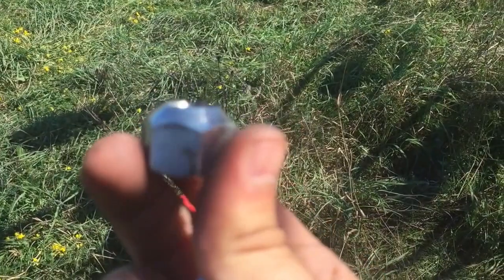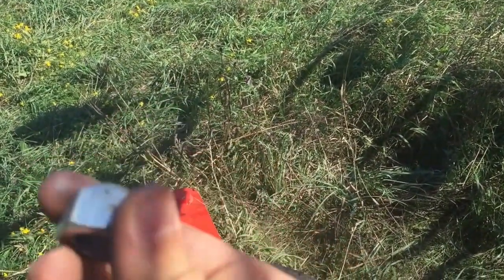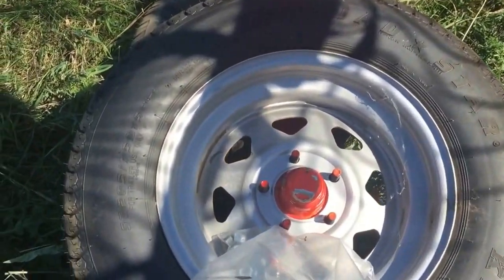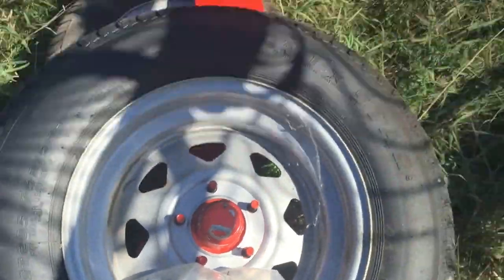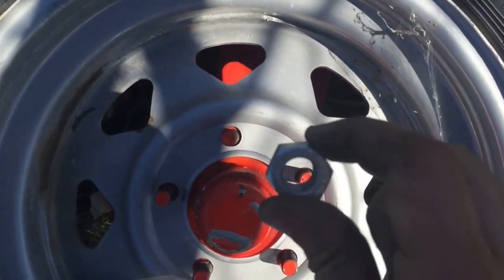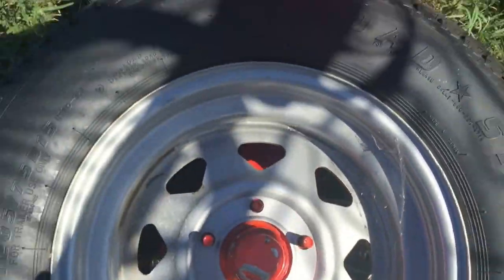Also, guys, if you take a look here, there are two nuts. There's a rounded one on the top. That goes to the inside of the tire, so you use those for any of the bolt-on tires. And where you strap it on to the main hub, they've provided a flat one. So just make sure that you use that rounded nut to go inside to the tire. If you're going like this on this tire, the rounded side is going to the inside to really give it a nice tight seal.